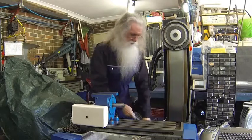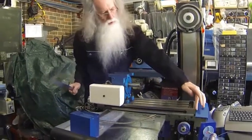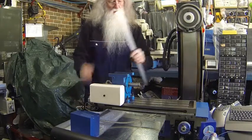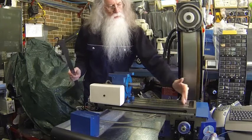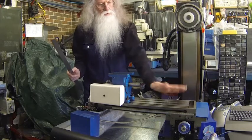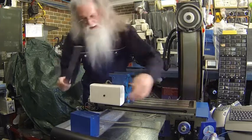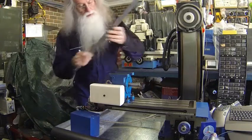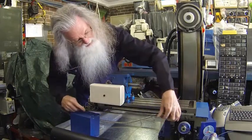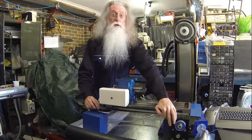What I was concerned about was the travel. As you can see on this side there's no motor — the motor is up on this end. I switched the motor around; the handle that's normally here will move along and hit the saddle. I've milled out clearance in the saddle so the actual bearing and end plate can clear it. The other end stop is on here, so the total distance of travel is now 397 — let's say 395 millimeters.